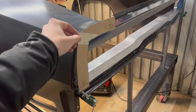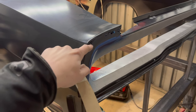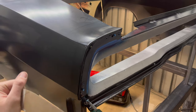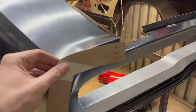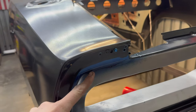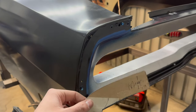The template fits well on both sides. AMD puts a little slot in the corner of these quarter panels so you can adjust — push it in or make it bigger — but you kind of just have to bend it to shape. The trickiest part is getting the bottom line of this corner piece to line up with the gap on the bottom side of the deck lid, and also getting it to line up with the radius on the end of the tail panel itself. There's a lot that goes into just getting these corner pieces aligned.